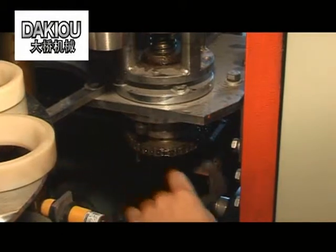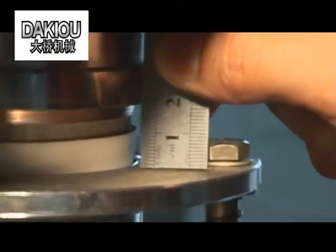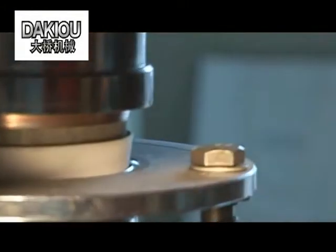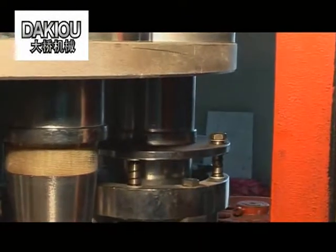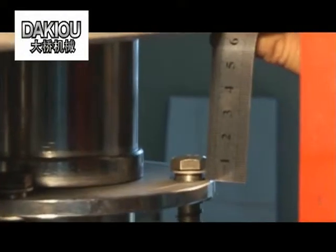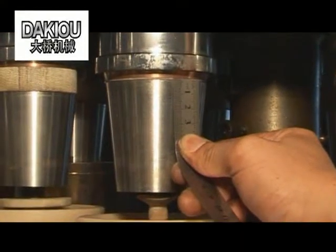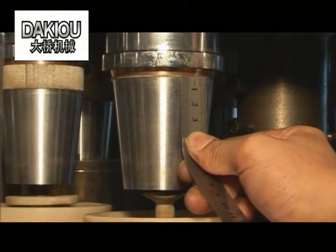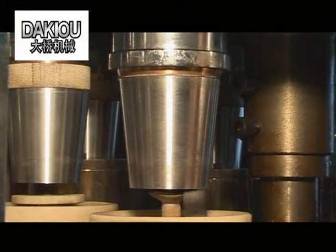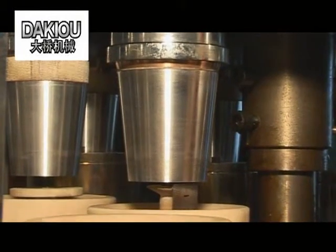Adjust the concentric points of the flange furnace and the cone shape, and the height of the flange furnace. Fit the paper tube to the furnace, with the paper tube 9 mm higher than the flange plate. When the pressure roller reaches the lowest point, the flange plate will be pressed downward 2 to 3 mm. When the pressure roller reaches the lowest point, the upper flange scraper is 1 mm to the cone-shaped die. The second plate will reach 2 to 3 mm to the cone bottom.